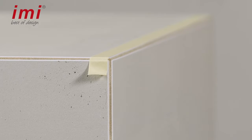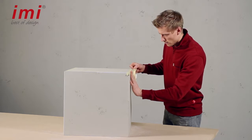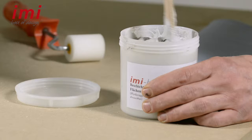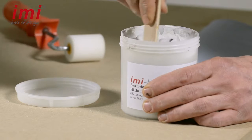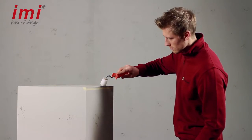The next step is to secure the surface to the edge by masking tape. Then you can apply directly the top color with a paint roller. After a short drying time, stir up briefly the coating mask and apply it thinly on the chamfer.